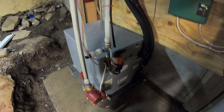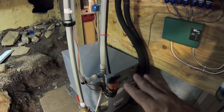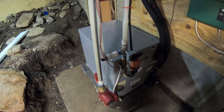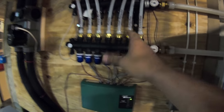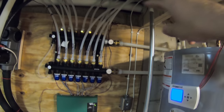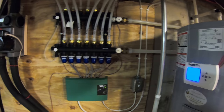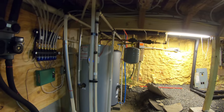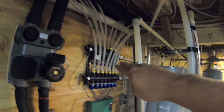So to have air conditioning in this unit, basically what you'd have to do, there's several ways. You could either have a fan coil system down here and then duct it to the rest of the house, or what you can do, and this is kind of cool the way this works, is you can actually use your existing lines here, but just add a couple zones in there for the cooling. And then basically what you'd do is you'd go to each spot in the house with just one pipe there and one pipe back, and then you would insulate those pipes because they're going to be having condensation on them and stuff. So you have to always insulate the pipes that are cooling, unless it's in conditioned space and exposed. And basically, you would run that to separate fan coils.